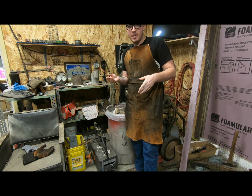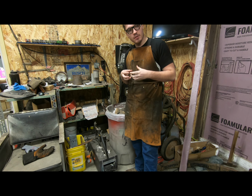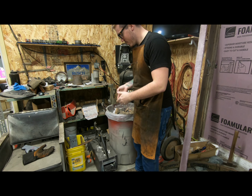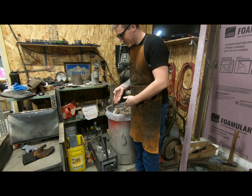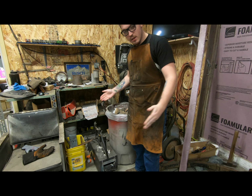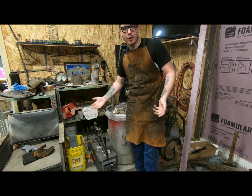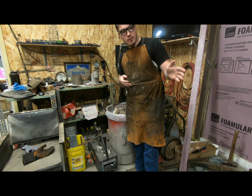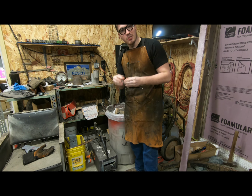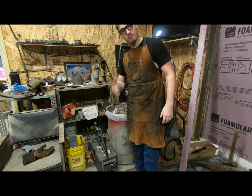All right, so it's been about a day or two, and I think I made a stupid decision to try to put the two together because now it won't fit in my regular forge, and I don't have the things to recoat this one, which is a 3-burner, much longer forge that would probably work. So since I can't recoat that just yet, I don't have the funds to do so, what I'm gonna do is try to forge weld the middle of that billet as good as I can, and then cut it in half and treat it like 2 different billets. And then we'll go from there. Ready for the journey.